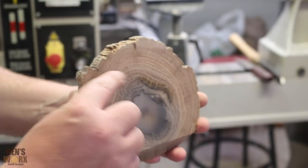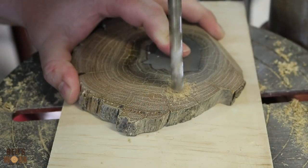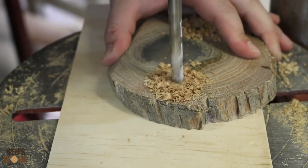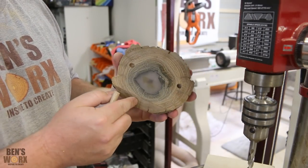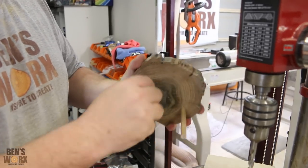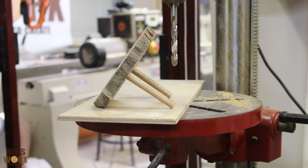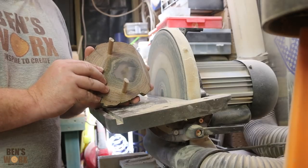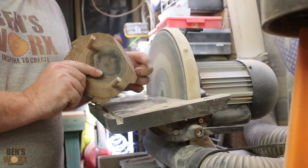My next step is to create some supports on the back so it doesn't fall over, and to do that I'll be using this Tasmanian oak. I made these holes slightly smaller than the dowel so I can put them in with just a friction fit. You'll notice I made these longer than they need to be — that way I can shorten them and get my angle just right. That process was super easy to do on the disc sander. All I had to do was grind these dowels down until this edge touched the sander.